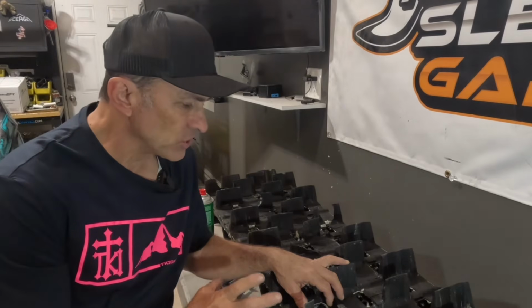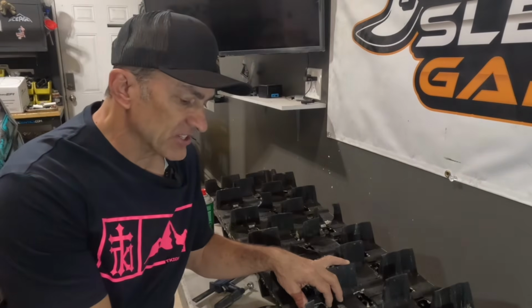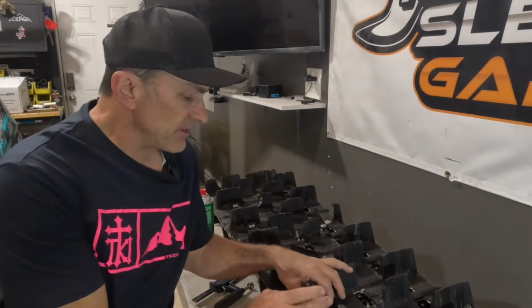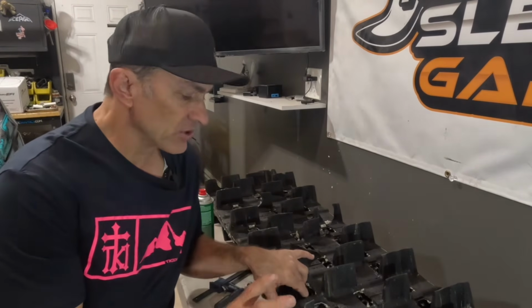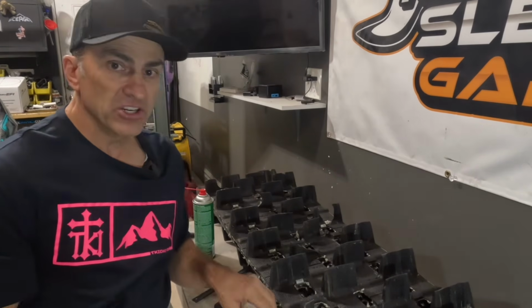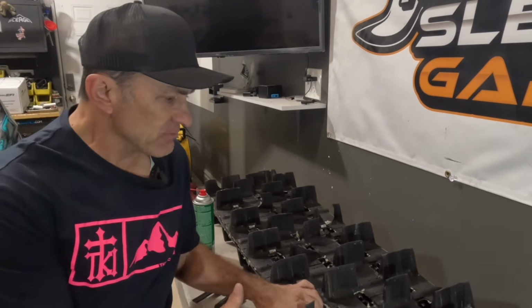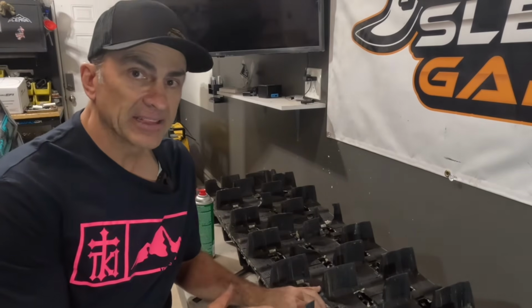So if you have anything torn through the cords on the belt of the track, it's going to be something you really are going to want to replace. But it's pretty common to get a lug torn off to where the cords are visible, but the cords themselves aren't damaged. And so what's common to do there, I have a little spot like this on this track, but I've seen much bigger spots that people have glued over just to protect that area.